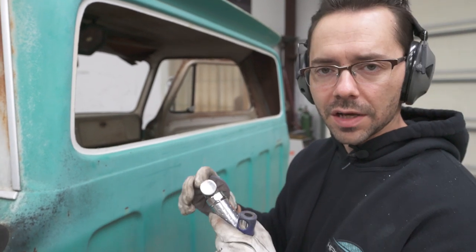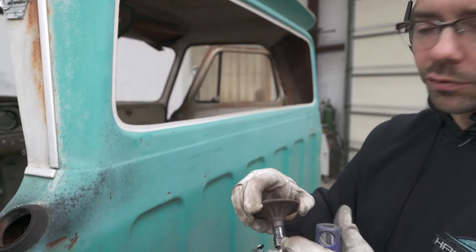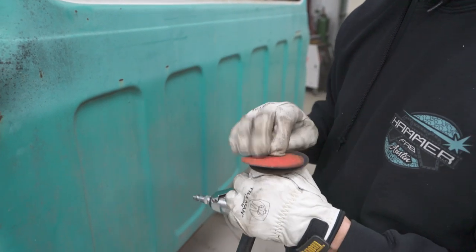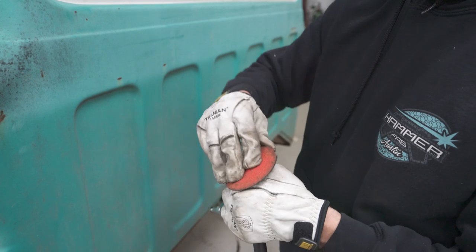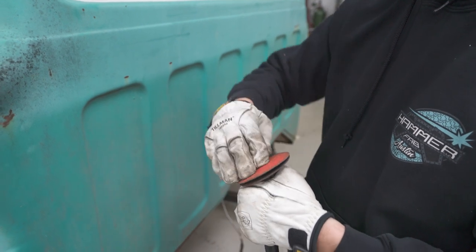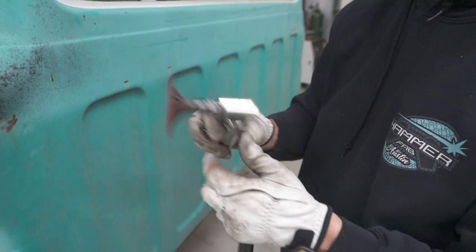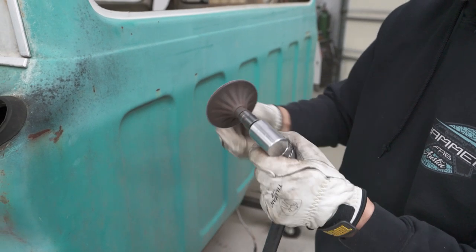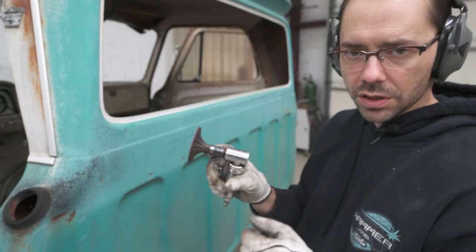We've developed these backer pads. They're 3-inch. They fit a roloc style abrasive disc. This particular disc is from Jag 10 tools. It's a 50 grit disc and it has a little threaded nub on it, and you just twist it on there and it holds it on. But our backer pads are really rigid. They're nylon plastic and they'll fit your common air tools with a 1/4-inch mandrel.